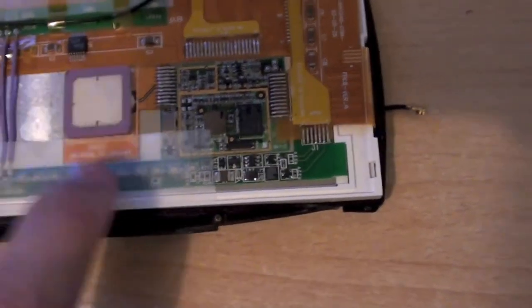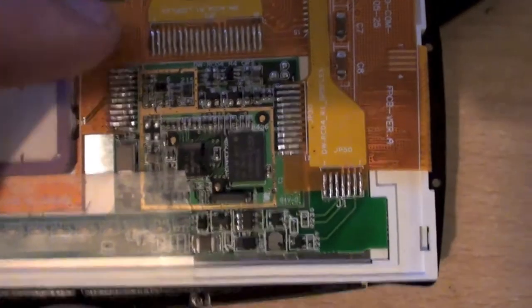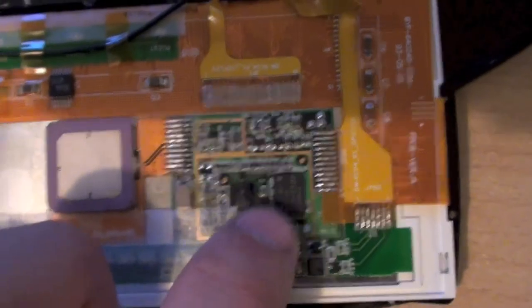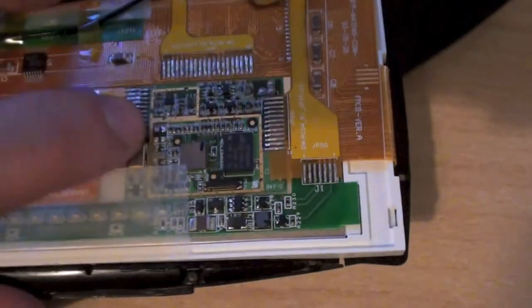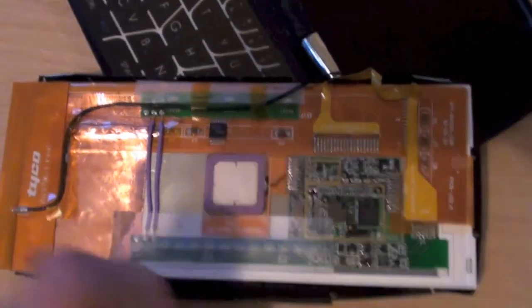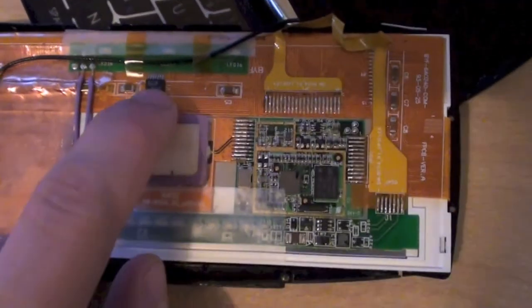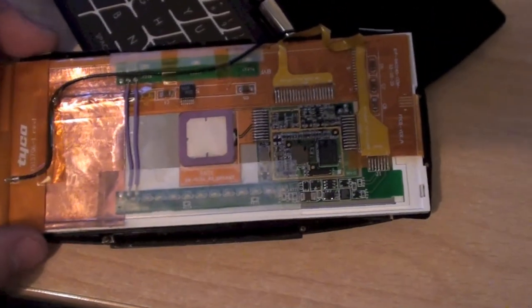Along the top we've got a series of LEDs which would indicate whether you had an email or something like that. We've got a GPS flex cable — it's all marked out, it says 'GPS flex cable' — and the LCD flex cable is also there. The GPS antenna chip is actually made by ST, so it's a relatively good chip. One chip appears to be silicon directly bonded onto the board with no housing around it. Apart from that, there's just the standard power controller chip for the LCD, a small capacitor, a few flex cables going to the main board, and that's about it.